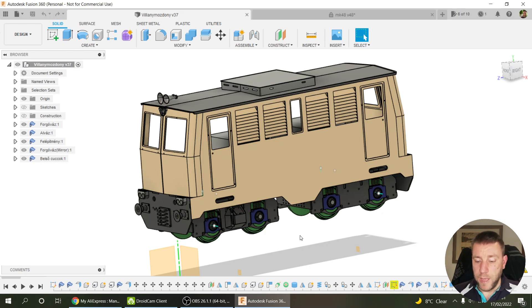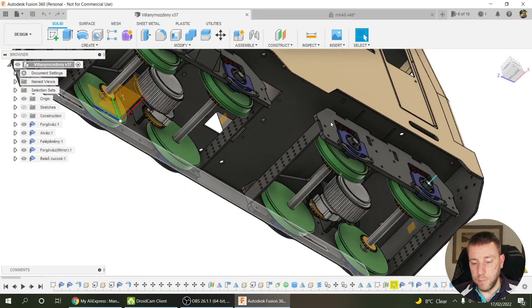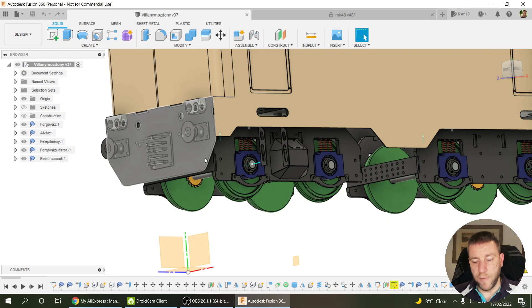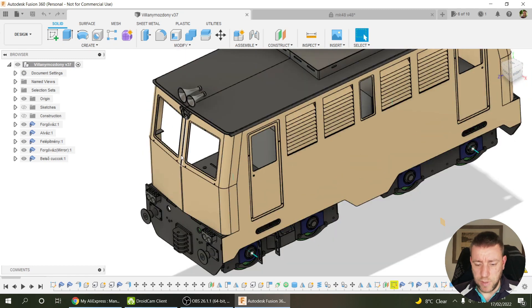There's definitely going to be a lot to work with. Almost everything in the bogey is 10mm plate, with the exception of the motor mounting plate and some small braces which are 5mm. The floor and the main front plates are 5mm, then pretty much everything else — the roof, sides, decorations, window frames, and door frames — is 2mm. The loops I made from 1mm because they don't need to be thicker.